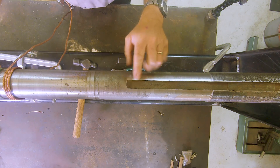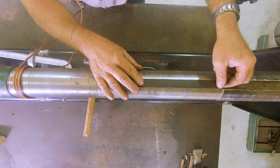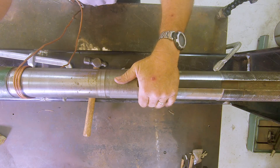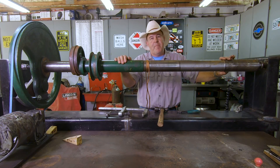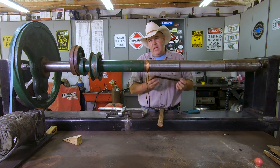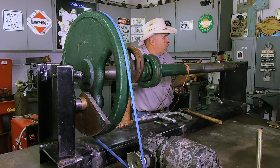What they did is cut a blank keyway for us. We're going to drop it in place right here, tack weld it in, and then weld over the top of that — which will essentially close up this hole but give us a continuous arc all the way over. Once they've turned this back down to diameter, they'll come in on the milling machine and open this keyway back up, preserving the key, because it's only going to be tack welded on the edges.